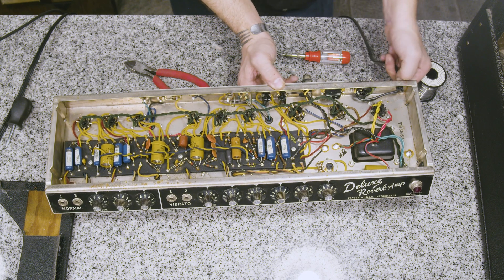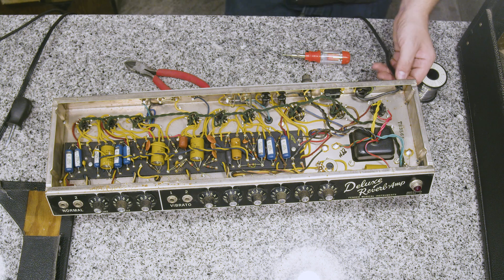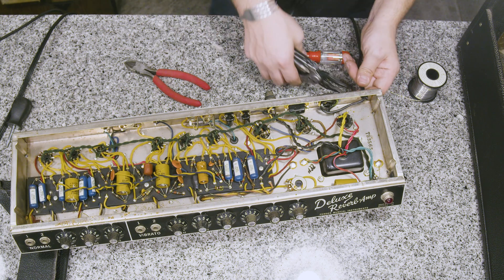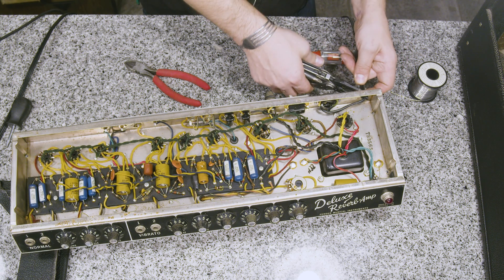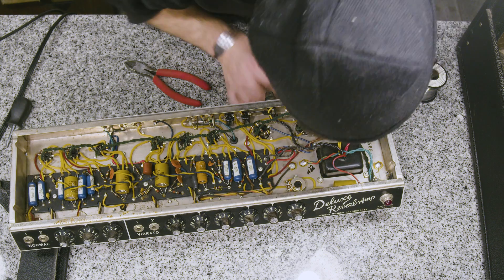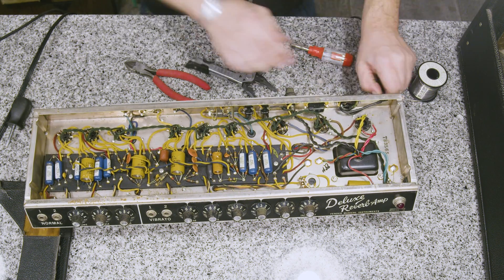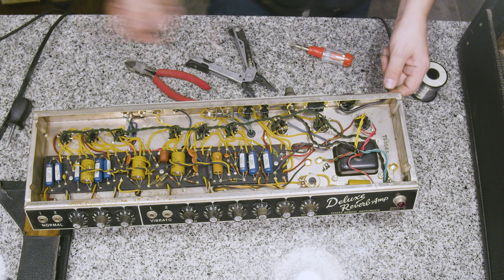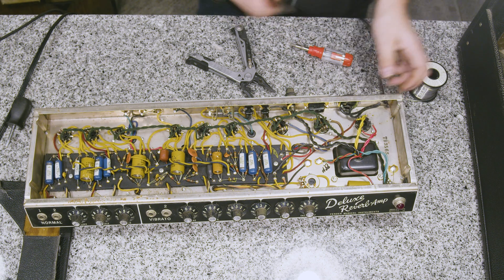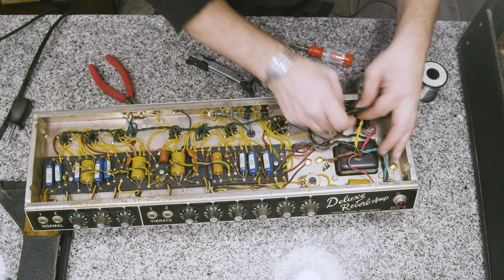Now let's replace this old two-prong cable with a newer three-prong cable with a proper ground and then properly ground our amplifier. All these old amplifiers have these cable glands on them — they're the worst things ever. If you take one side of it and depress it, you should be able to wiggle it into the amplifier. The top lifts off, which crimps around the cable, and now our cable is loose. For ease of sake, we're just going to clip this.